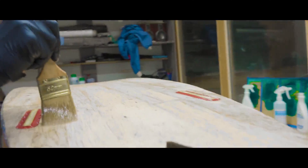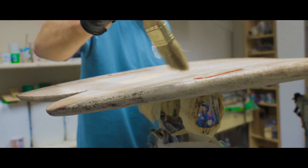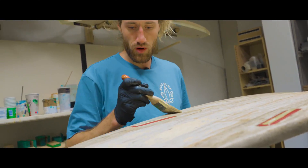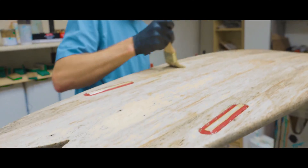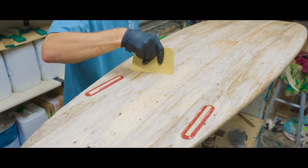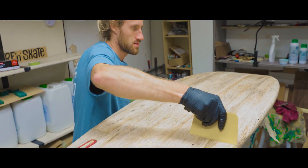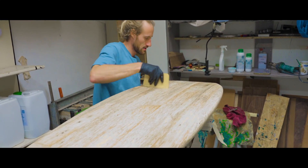If there are some dry parts, also don't want dry parts on it. Not too much, not too little - just the right amount is perfect. On this board we use 150 grams of epoxy for the sealing. Boom, nice - perfect, the bottom part is nicely and perfectly sealed up, light as well.